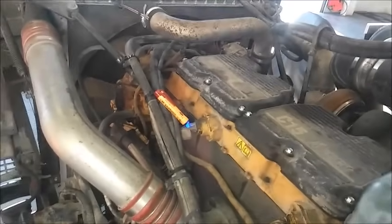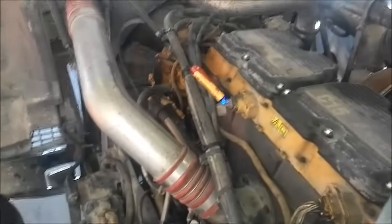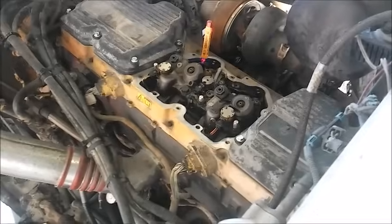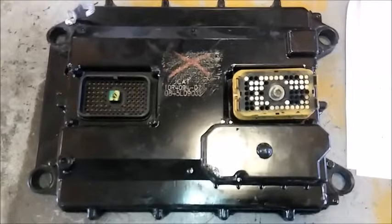The ECM on pretty much all newer diesel engines fires the injectors with a voltage signal, and usually that voltage signal is higher than 12 volts — on a CAT it can be up to 120 volts. So place the inductive voltmeter in your harness, just next to some wires, and then crank the engine. Is it turning red? If it is, that means the ECM is sending a voltage signal to fire the injectors. We're going to actually see it firing an injector or at least trying to. If it doesn't light up, the ECM is not trying to fire the injectors and you may have a problem with the ECM or the wiring supplying voltage. We can see while cranking that it is lighting up — so we have determined that the ECM is trying to fire the injectors.